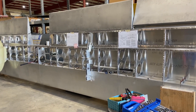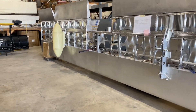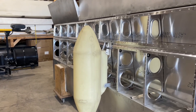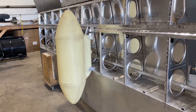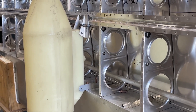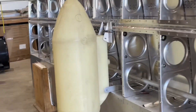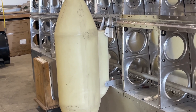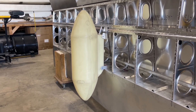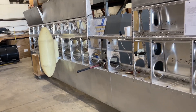I'm working on the mounting points for the external tanks on the Titan Tornado. The old system used plastic tanks as external fuel tanks, with four brackets — two mounting to the D-spar and two sticking out from the skin — pinned in place. That tank is now obsolete. John said they stopped using it, but I still want external tanks for the extra fuel capacity.